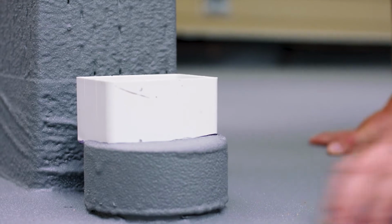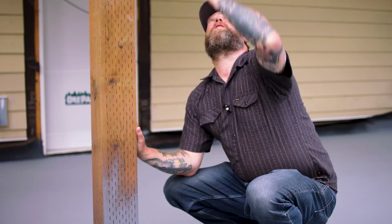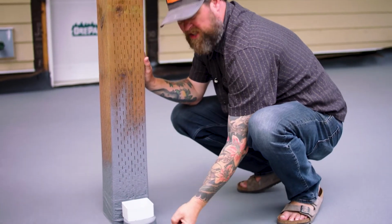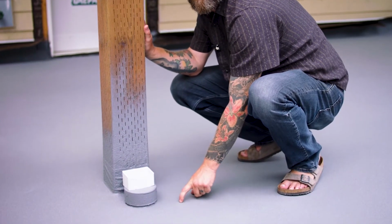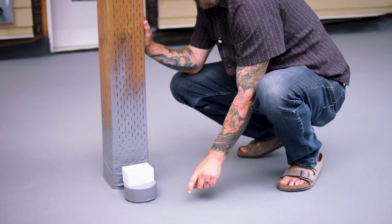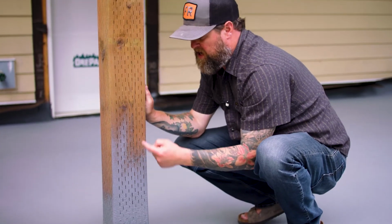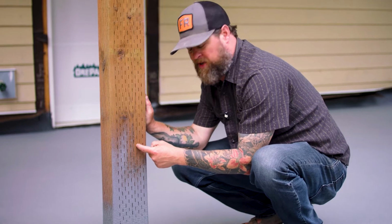The other important part of deck waterproofing is any and all penetrations that go through the deck. There's gonna be a downspout that's gonna come down and come into this. Obviously, that's what this is for. This is PVC. So this Polyurea can actually go from the plywood and then on to the PVC. Polyurea cannot stand treated material.